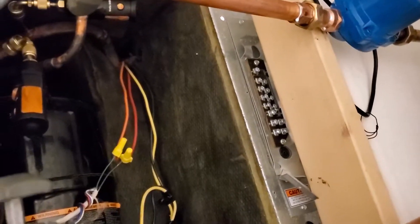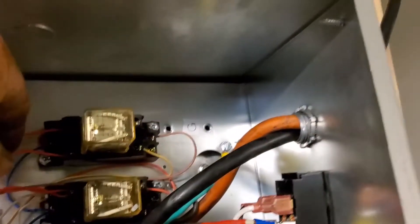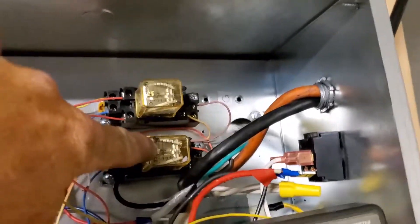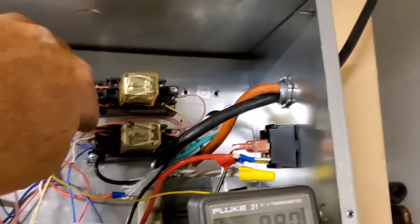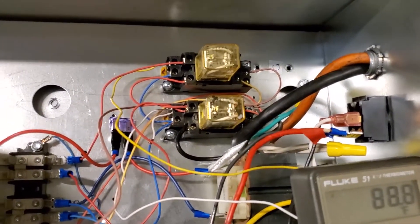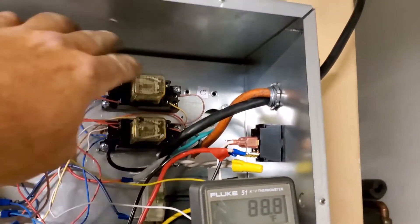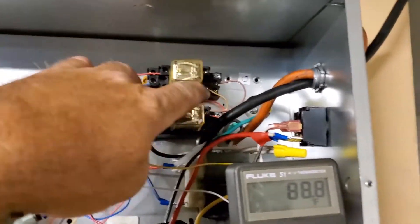One thing I do need to come back and hook up is a high-pressure cutout, which this does not have right now. The setup right now is just digital dry contacts — that's what I've mainly been connecting here, and this will be what I'll be using for the controller anyway. This one here, a two-pole relay: when it pulls in for first stage it closes the 120 volts going out. I also have a dry contact going over here — I hate sharing a cube relay for high voltage and low voltage, I know it's a no-no. Maybe I'll switch it when I find another matching one.